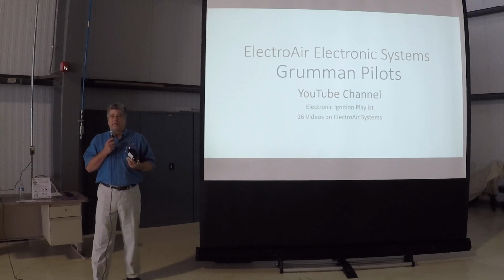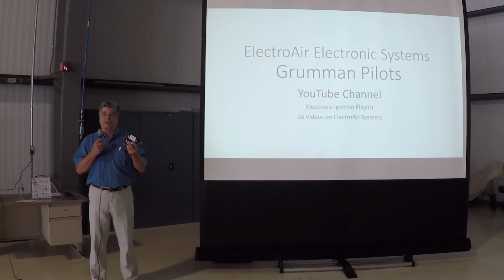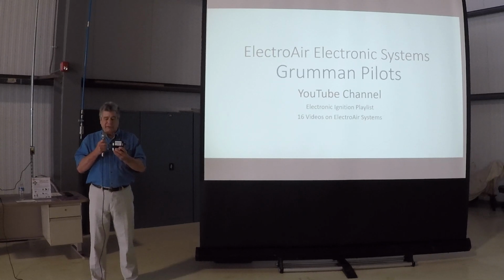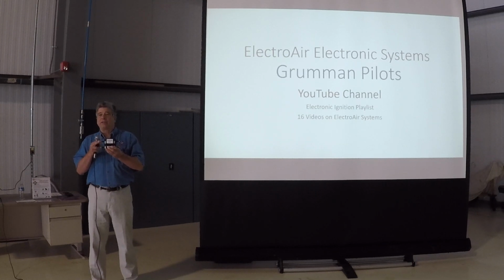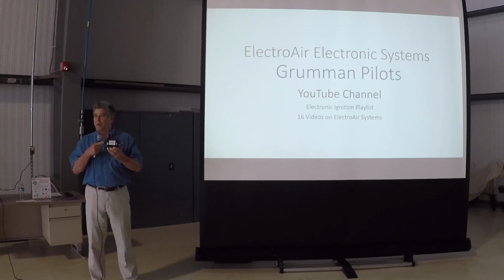Now, Aviation Consumer in their May edition just did an article about ElectroAir, and they got a couple things wrong. They said that the wasted spark was because by the time the magneto fires and cruises, the electronic ignition system has already gone off 20 degrees earlier. It's burned all the fuel, so it's a wasted spark on the magneto. Wasted spark actually applies to the fact that every time the piston on the electronic side comes to top dead center, power stroke and exhaust stroke, it fires the spark plug.